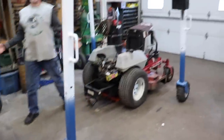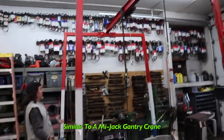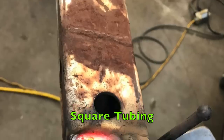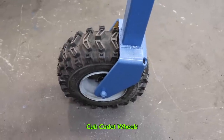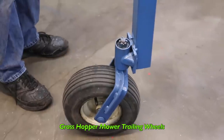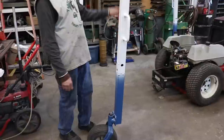It's like a little mini mi-jack travel lift — if you know what one of them is, if you don't, Google it: mi-jack travel lift. It's a rolling gantry crane that I made out of some square tubing and some casters from zero-turn mowers. Those on the back are from a Scag Cub Cadet, and the ones on the front are trailing wheels from a Grasshopper. I built this thing for about a hundred bucks — all stuff I had laying around the shop.